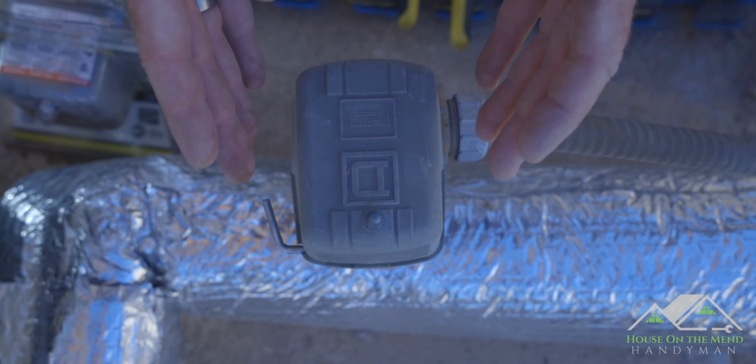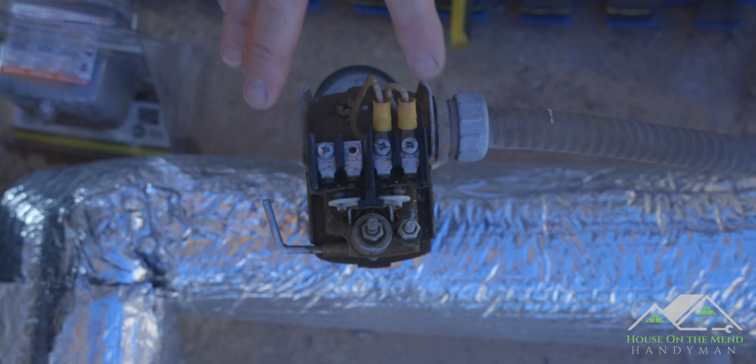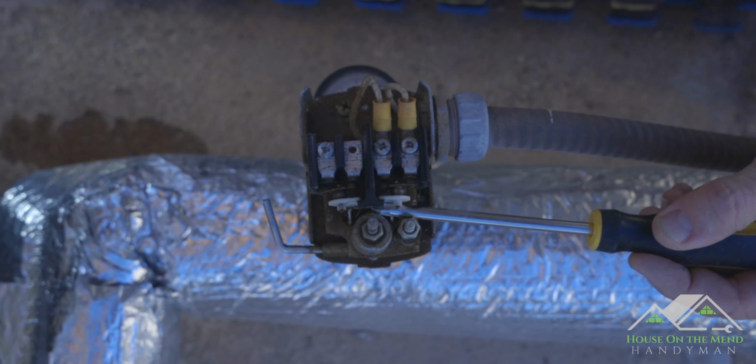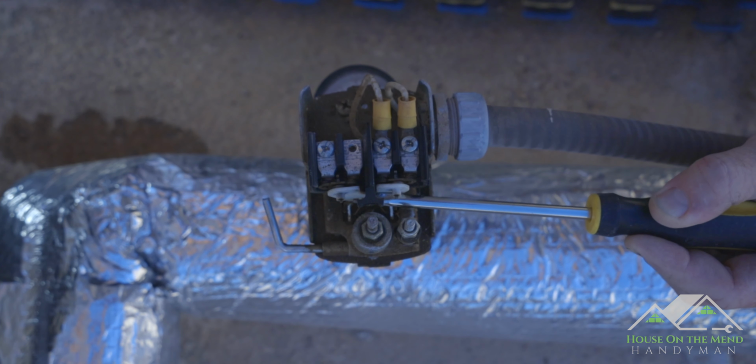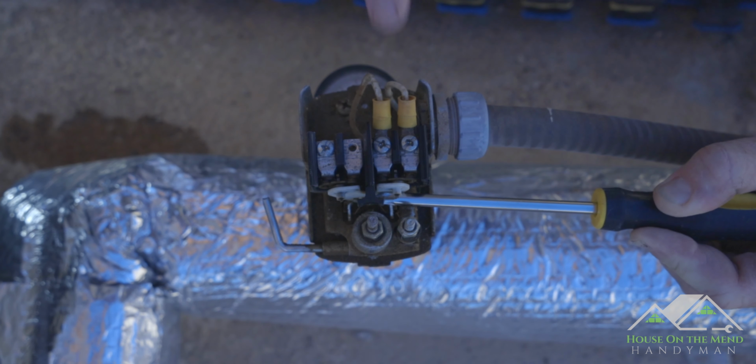So, now that we've drained the water off, we can start looking into changing out the components here. So for safety's sake, the first thing I wanna do is make sure that there is no residual electricity from the capacitors inside of the well control. So I'm just gonna come right in here and against this plastic piece, I'm gonna close the connection and just make sure that capacitor is all drained out. That way I don't run the risk of getting shocked or doing anything that's gonna damage our well control system.